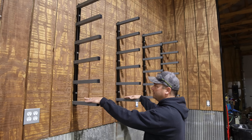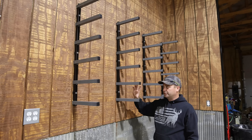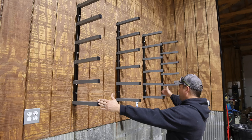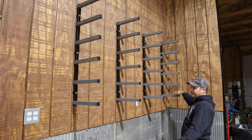We've got all four of the racks mounted to the wall. One pair of these would hold 660 pounds, so that was 110 pounds per level. Now that we've got four going across here, in theory you could put 220 pounds per level — but you're never going to get that much weight on here since there's only six inches between these. According to the instructions, you could mount them either four feet apart or six feet apart, but I think six feet is just too wide and your boards would sag. So I decided to do four — it is overkill, but I think it's going to work out good. We're going to go ahead and load this stuff up — we've got a bunch of lumber filling up one of these garage bays and we'll see how much of it we can stack on here.